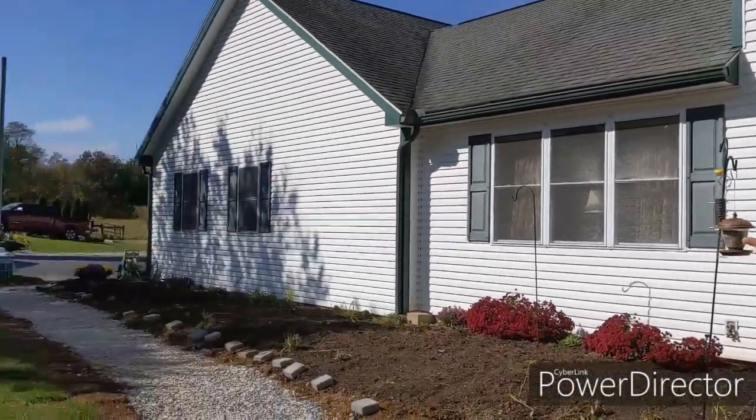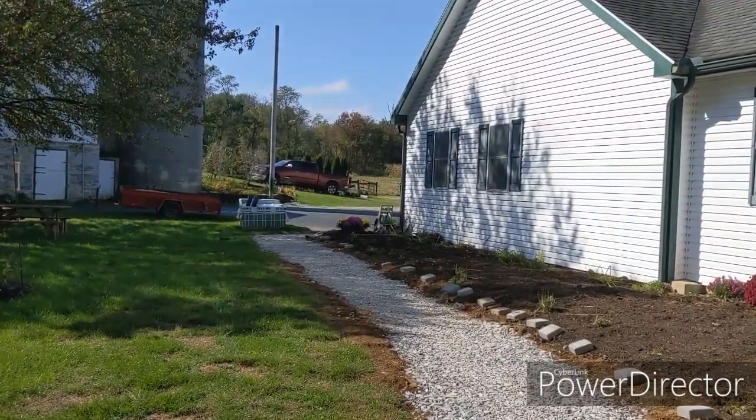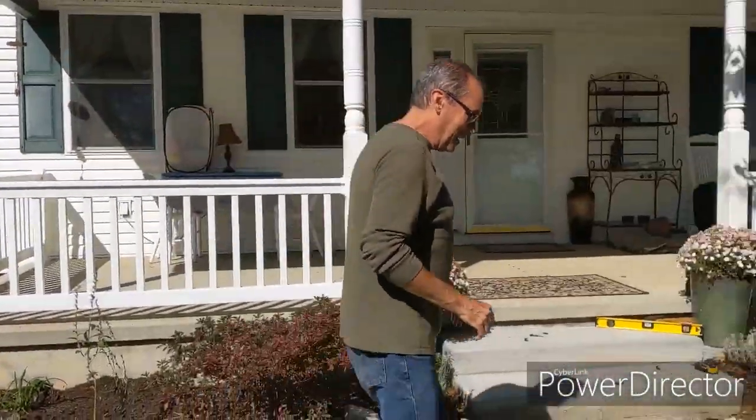I ran it a little bit but I've got a lot more work to do on it. After that, I have some sand to put in. I picked it up today from the quarry — it's a concrete sand which is a little grittier and it will bind better. I don't use play sand because it just doesn't compact. So we got the right sand. We also had the delivery of the pavers, and the pavers are a light gray to pick off the stone on the barn. Let's get started and see if this compactor works.